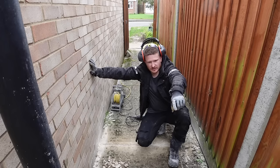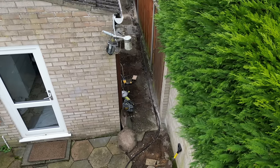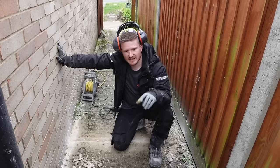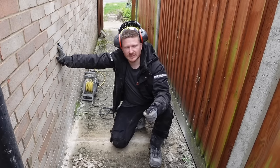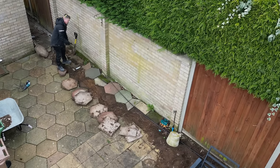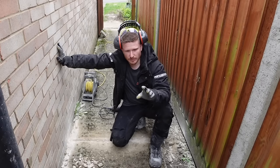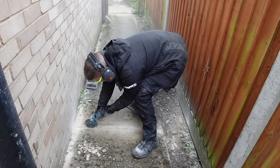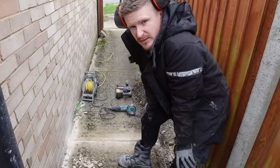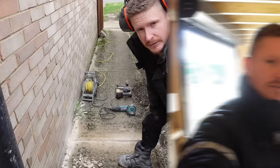I've dug from the workshop all the way down the side of the garden, under where the new paving slabs are going to go, so I'm not too worried about that. The old paving slabs will go back over this until we put the new ones down — if you lift those slabs you'd see the cable anyway. I'm just cutting this little channel across here so we can gland the armor cable off. As long as the cable is either visible or protected, I'm not too worried about this being perfect for now.